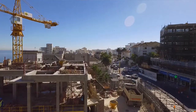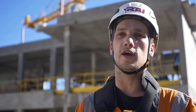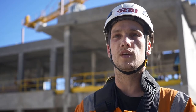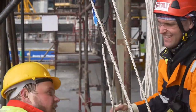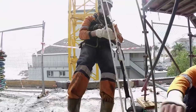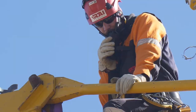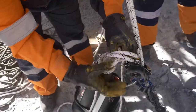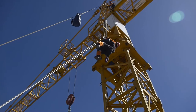For our setup, we basically put PPE anchors into the ground. We drilled them in, we load tested them, we set up the winch, we set up the first lines, we got our guys up. We set up our tension lines on releasable rope grabs so that we wouldn't overload them. We did the same with all our hauling lines and everything was backed up.